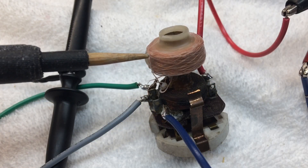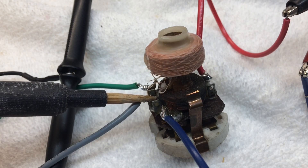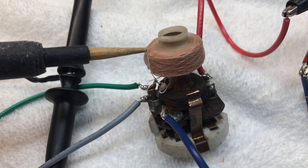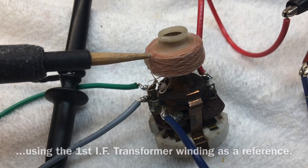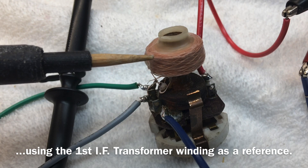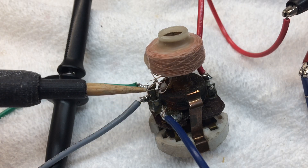I've got the coil placed back on the original former, slid that over the coupling. That is the correct distance between the primary coil on the bottom and the secondary coil here, putting me back at the same position as the original coil. The inductance of this coil is about 200 to 300 micro-Henrys less than the original, so some additional capacitance may be needed when back in circuit, though there should be some stray capacitance.